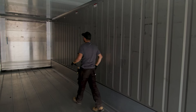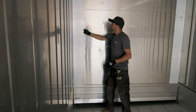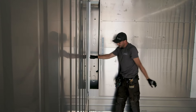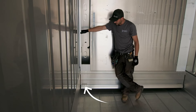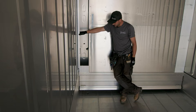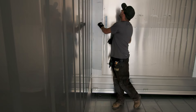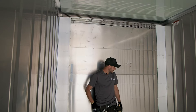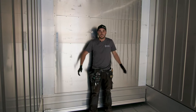At the back there are cabinet-like spaces on both sides of the bulkhead, with electrical connections where you can download all the data from its trip across the ocean. There's a nice little storage space back here too. The drain is visible on the corners, and up at the top the grate is the supply - that evenly distributes the air as it exits the reefer unit. If this unit came off, the hole through the wall would be pretty much that big.